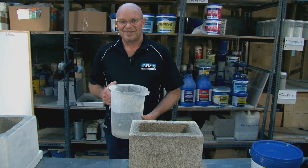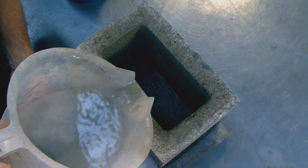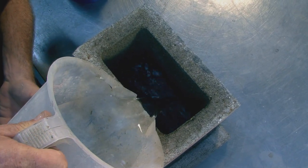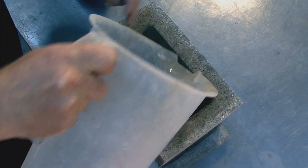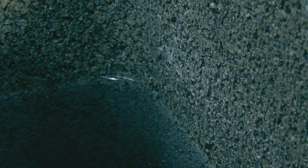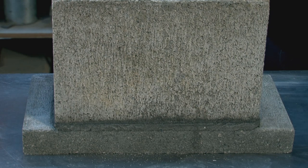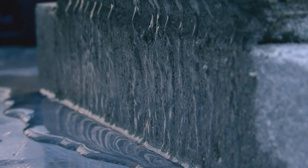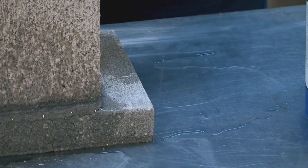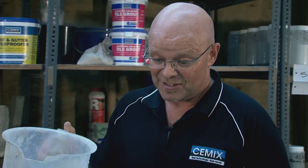Now what we are going to do is show that this experiment actually works by pouring some water into this untreated block, and let you see just how porous it is and how quickly the water will run through it — and therefore what can be happening at your house. The water level is dropping, filling up the block. Now we can see water escaping through the mortar lines, beading on the side of the block, drip lines there, and water pooling underneath. So if you've got a drain blocked behind your house and water is able to pool behind the wall and your waterproofing has given up the ghost, this is what's going to happen.